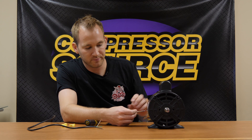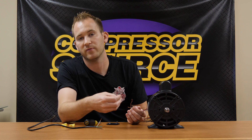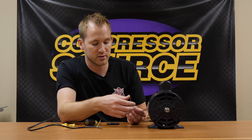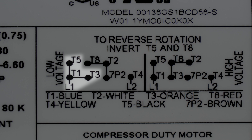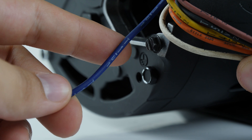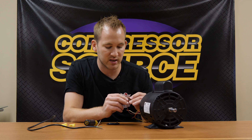For low voltage — which would be 110 volt — the diagram says T5, T1, and T3 go together. On this particular motor, T5 is the black wire, T1 is the blue wire, and T3 is the orange wire. So these three wires get connected together. High voltage would be referred to as 220 or 230 volt depending on your application.